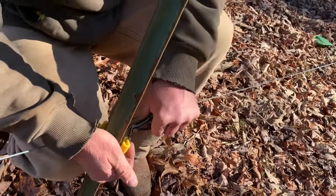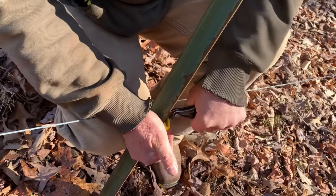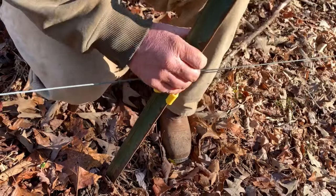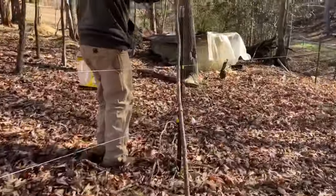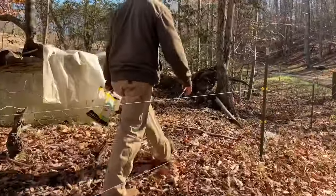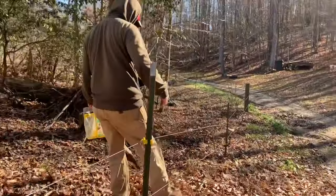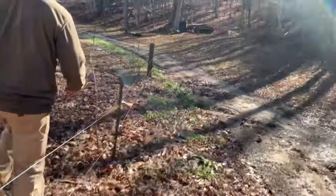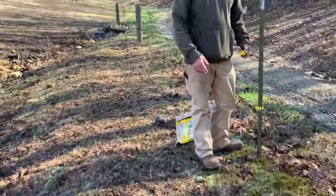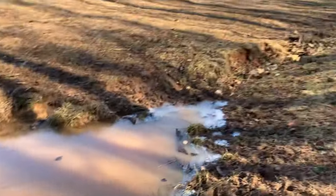Well, lunch is done — we've got to go back to the house. Can a stick touching the ground be killing power too? A stick won't kill a lot but it seems to bleed some power. This whole ground's frozen over here — down here in the shade and the hollow it froze. There's another broken insulator yet again. This one wasn't touching the post though — this one was just kind of hanging out by itself. The insulator was just gone, and when we found it down below, the back clip had broken off.